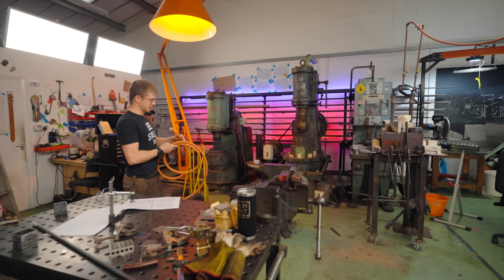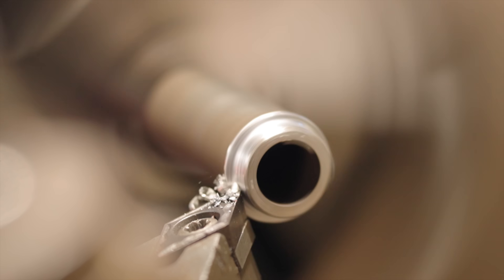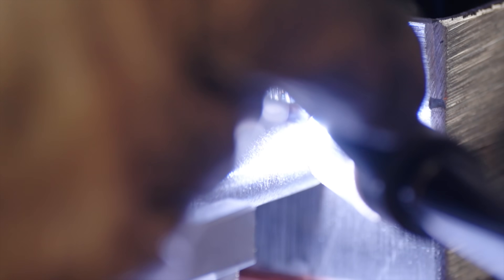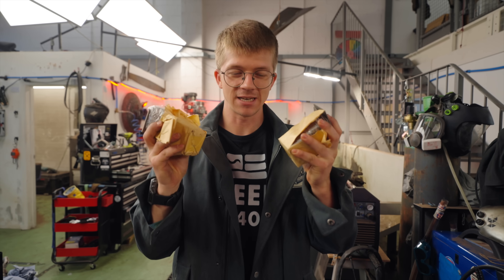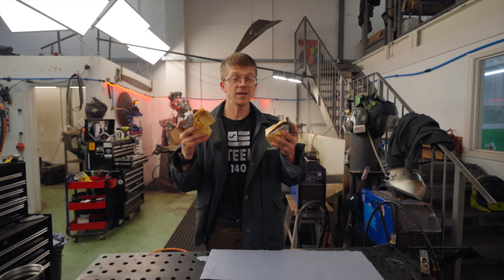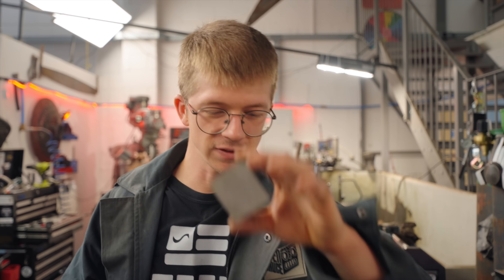I got some hose — I just used water hose. Grind this down, we can shove it in. Better yet, we use the lathe. That should do the job. Now all our material needs to be dead clean — super-duper clean. No oxides, oil, dirt, debris, none of that. This is important when you're making steel Damascus, but when you are messing around with this much money's worth of titanium, it's all the more important. Speaking of which, for all four of these bundles it cost me 500 pounds — it's like $700. This one little bit of titanium is £2.50. Goodness gracious.